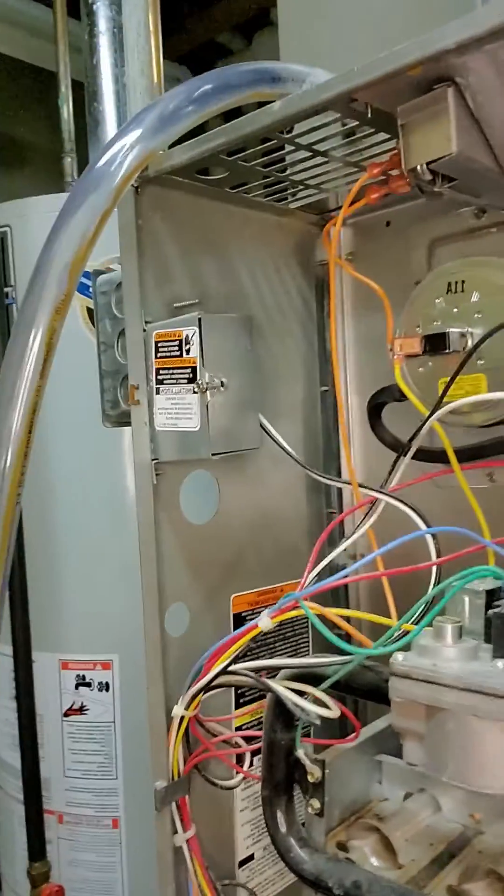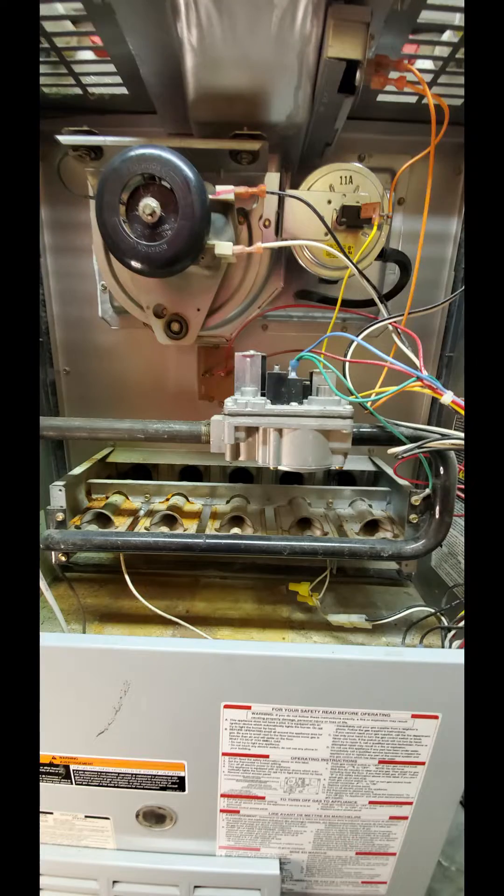Now that you have the panel open, I'm going to show you what happened with mine and you can try to figure out if that's happening to yours. Here's the part of the system we're going to talk about in its entirety. Pretty much all the hardware components. You have to understand that each of these components sends a signal to the circuit board, and the circuit board decides if the complete system is ready to fire up. If you're having a problem, you can take your voltmeter and trace these wires to determine where the signal stops.